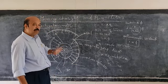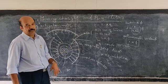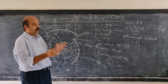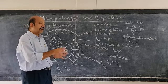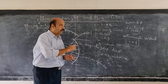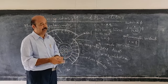And since a galvanometer, as I said earlier, is a very sensitive instrument, to convert it into an ammeter for measuring current directly, a suitable modification is done, and also the scale is calibrated suitably, so that the needle moving over the scale gives the reading directly.